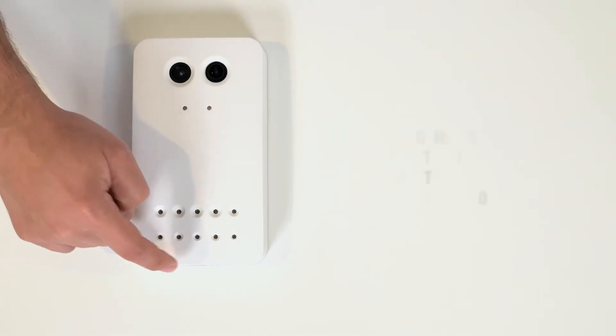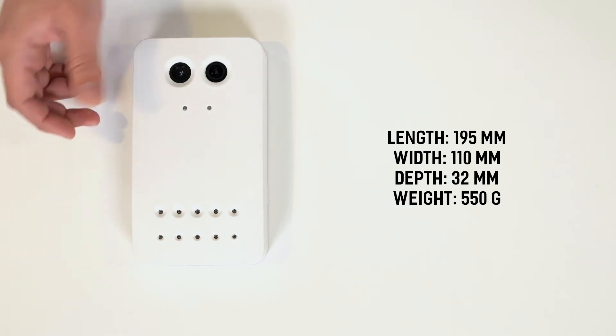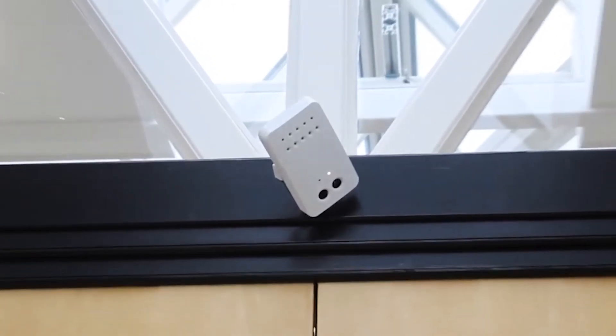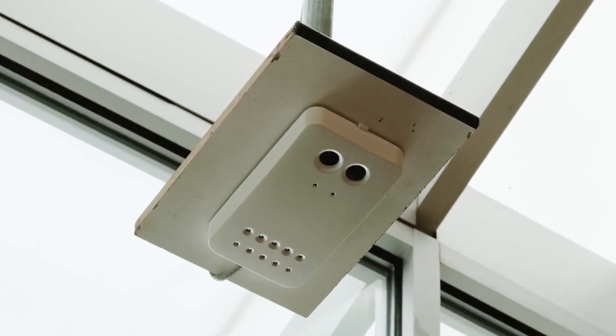The device has a length of 195 millimeters, a width of 110 millimeters, and a depth of 32 millimeters, weighing approximately 550 grams. You can install the device tilted at a 30 degree angle or simply above any area you wish to monitor. A drop hole may be required for ceilings greater than 4.5 meters.